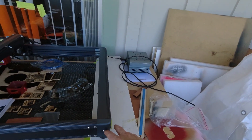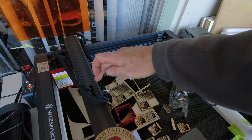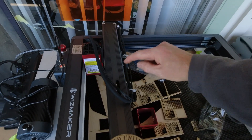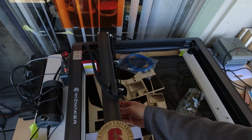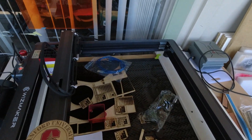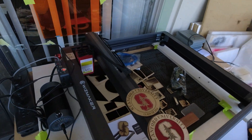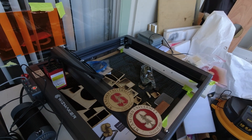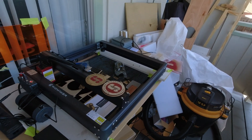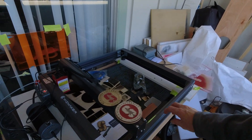I think the X-Tool has this as well, and it is so perfect. And the fact that you can get to the eccentric — or concentric — nuts easily to make the pulley move is great. It was a little stiff right to begin with, but that's easy to fix, and then there are two on either side that I adjusted a little bit. It was just so easy. I've actually made videos on lasers and how frustrated I was — I think it was the Atomstack where I had to put it together like four times. This one's just solid. It's built like a tank.